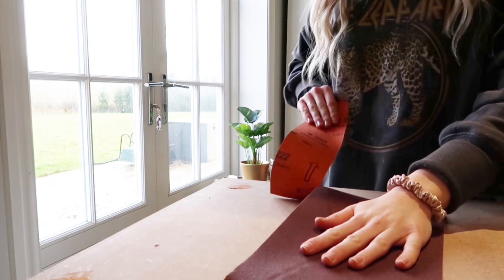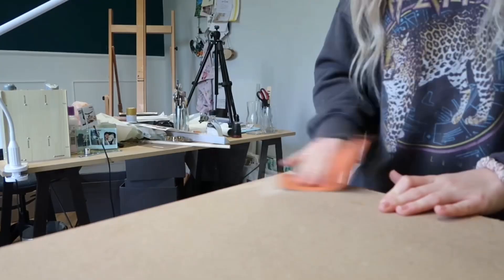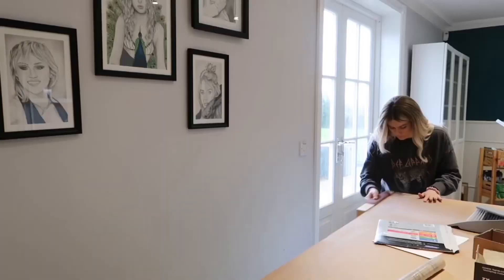All of my edges are smoothed down and the top is as well — all the filler I did. I'm going to rough it up. I could have probably done with 80-grit sandpaper but I only have 120. I've just watched the video and it does say if you're using untreated MDF you should use a primer. But I don't have a primer so we're just going to go for it. I think as long as I use a hairdryer — if there are any areas that aren't sticking that well, I'm going to use a hairdryer to heat up the adhesive. And when I go around the corners I'm going to hairdryer it as well.